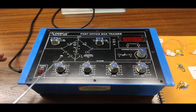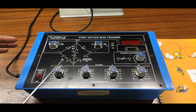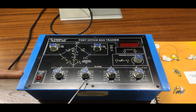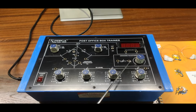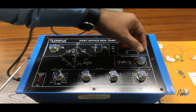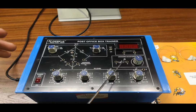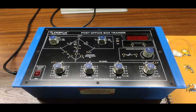This is the R3 resistance, which will be connected in different decade combinations. We have provided 10 steps of 1000 ohm resistance, similarly 100 ohm, 10 ohm, and 1 ohm resistance. This is the unknown resistance with different values of potentiometers, by which we can set any unknown value. The C and D points will be connected with the R arm of this unknown resistance in the Wheatstone bridge.